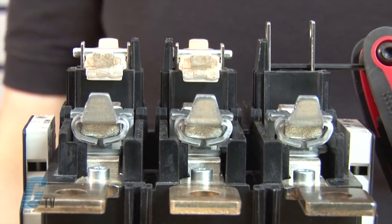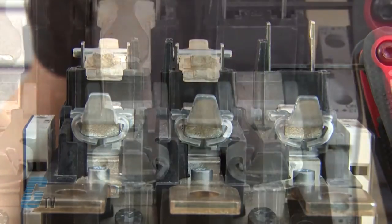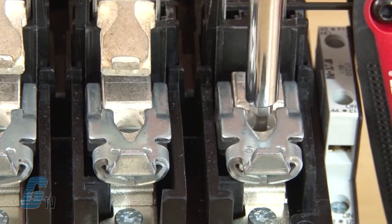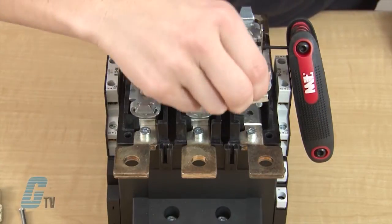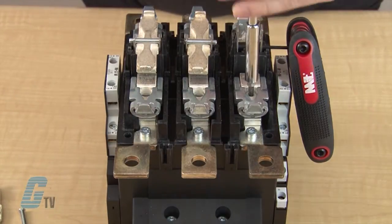I will keep the peg on the side for now and leave the hex wrench in place so that I can work on the contacts below the plate. I will insert a screwdriver with the size T25 star bit into the opening here. After the screw is removed, I can take out the contact and drop down my replacement and screw it in with the screw that I just removed moments ago.